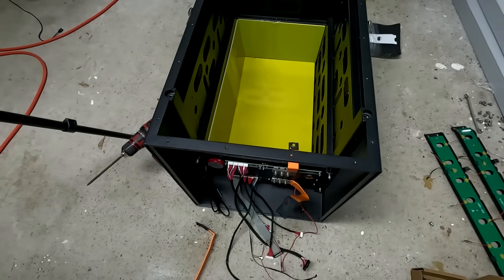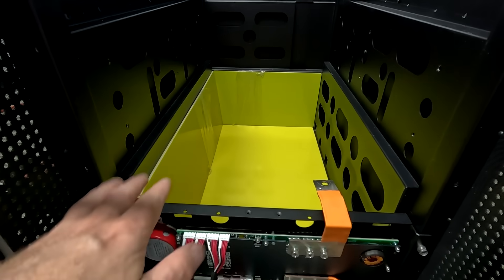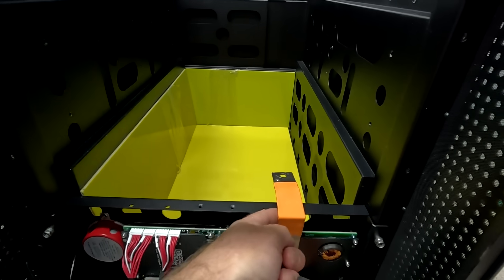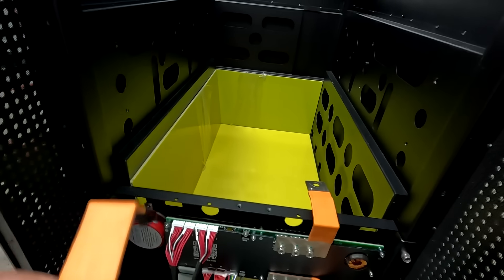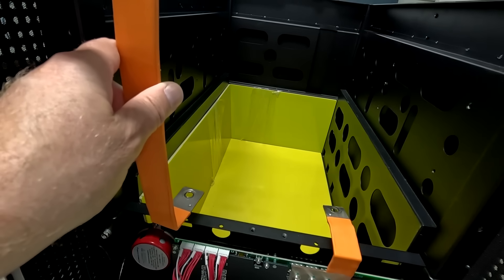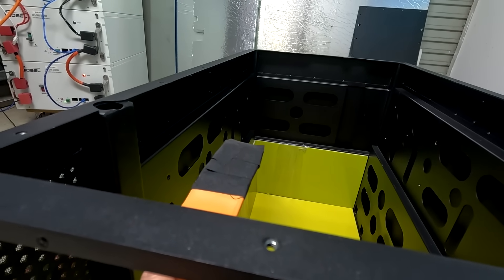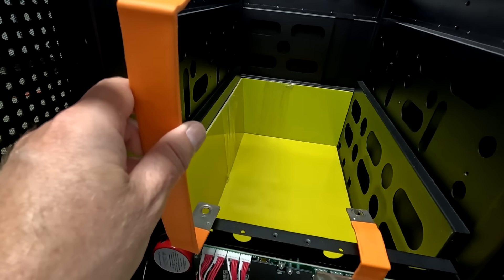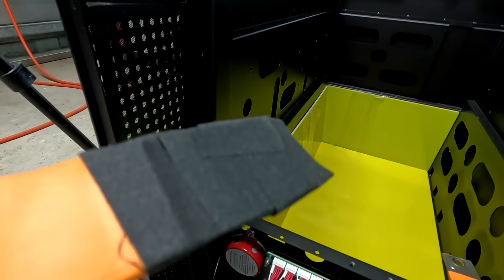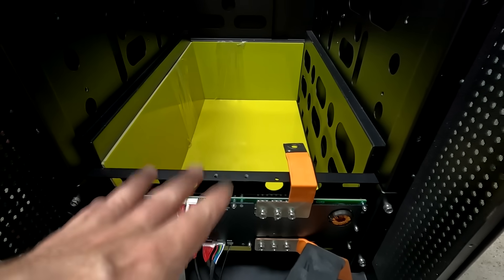The concern I have with this design is that once you build your bottom floor battery stack out of eight MB56 cells and connect them with the bus bars, you have to connect the negative of the BMS already. You also have to put this link in already, going from the positive of this 24 volt battery all the way to the top. And obviously this is all live - you're working with all these live parts, even if it's only 24 volts. That's probably why they've isolated the end of this link and the same for the negative.